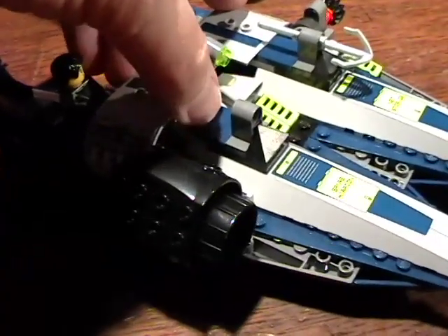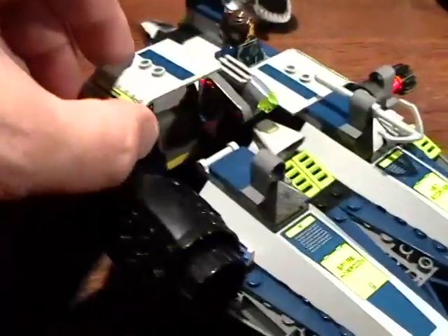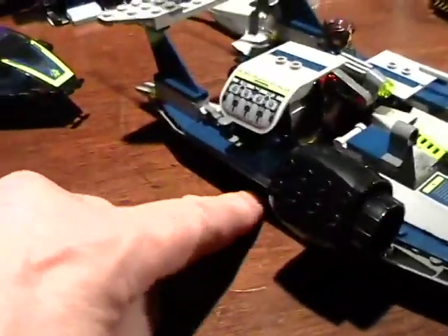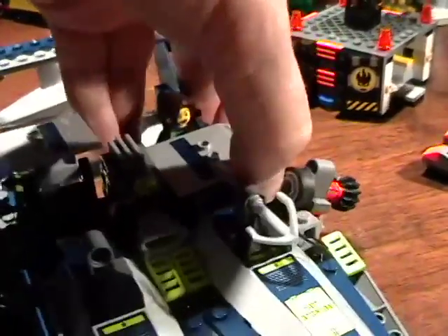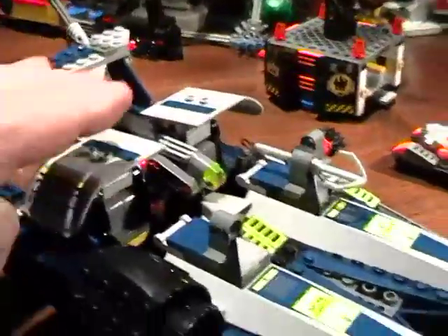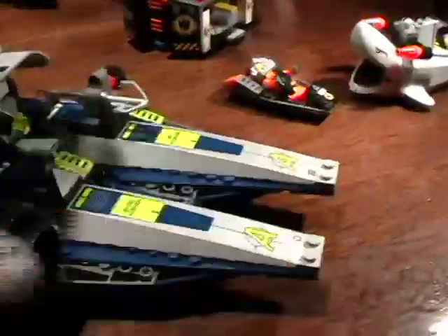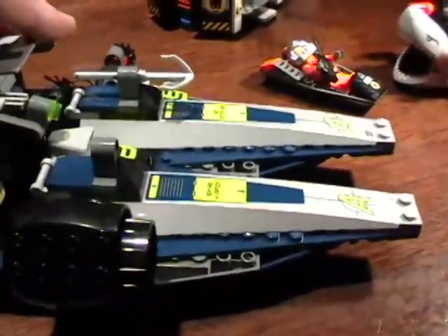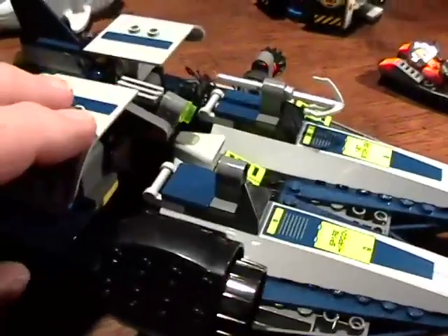I said this was not a hydroplane boat, but a hydrofoil boat. See, on a hydroplane boat, you have hydroplanes that come up underneath the bottom of the boat and put the boat in a planing action on top of the water. These are hydrofoils. And when you mount them up, they have a tendency to push the boat back down toward the water. In other words, when the boat is going so fast over the water, these act like scoops, scoop the air up, and then push the plane back down on the water.